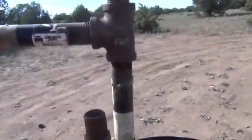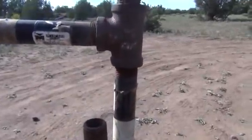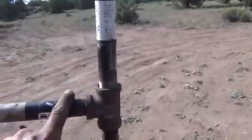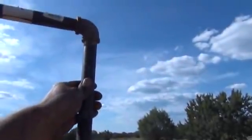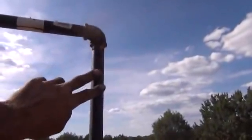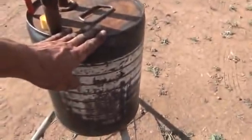With the wind here it's a little difficult to tell, but there's some gas starting to roll out right there out of the top. All I have to do is shut this valve when I'm ready and the gas is going to start working its way through the system much more effectively. As this gas starts to cool, it's going to come up to here and work its way uphill. The hydrogen inside of the gas will be the lightest of all the gases traveling uphill and definitely make it over the top. Much of the creosote will re-drip down into the second collection container here.